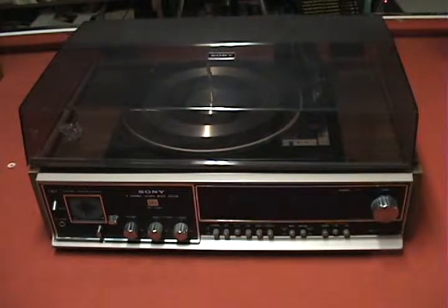And it really failed with vinyl because there were two different ways that it was recorded onto vinyl. You could either have discrete channels, which had four channels completely separated, or you could have a matrix encoded two channels, and then the quadraphonic system itself would take the two channels and split it up into four. And this gave it some backwards compatibility with standard stereo turntables. But if you had the discrete ones, you couldn't use those on regular turntables at all. You had to have your quadraphonic system.